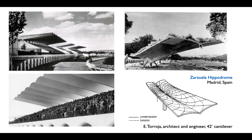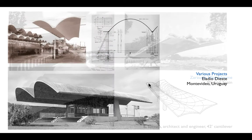It's a little bit thicker at the top, which acts as the compression flange — since it's a cantilever. And there will be lots of reinforcing at the lower edges, acting as tension flanges. We have the flipped-over version of isostatic stress lines: compression is solid, tension is dashed, and reinforcing goes right there.